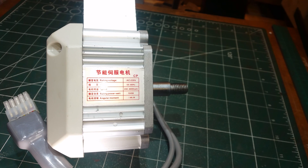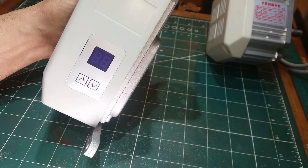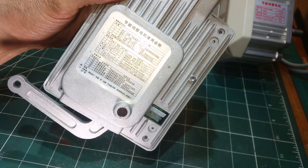This is the motor I've got to replace the old one with. It's off an industrial sewing machine and it is brushless. Single phase, runs on 50 to 60 Hz, 220 volt AC power. It's 550 watts — about three quarters of horsepower — and it says 4 Nm torque. It has an operational speed range of 200 to 6,000 rpm. The old motor I just took off, I believe went up to 2,000 rpm. What you also get in the package is a speed controller and readout, an English language manual, and an on/off switch.